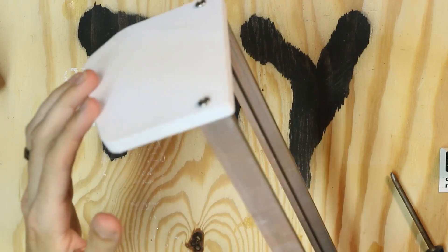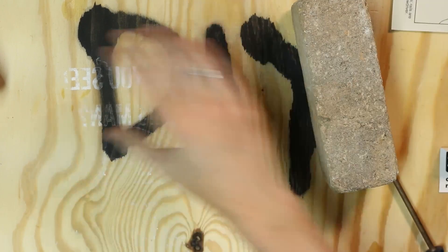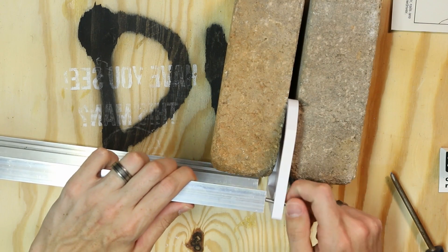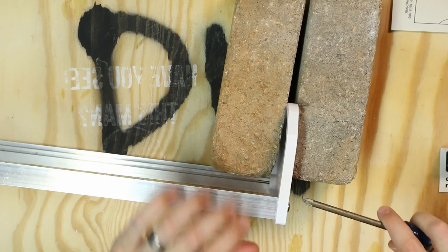I went for a bike ride because these side panels take a surprisingly long time to print. Now I've got both side panels and I'm going to attach them to the rails. I'm leaving the sides open for now but might close them later with acrylic. These screws drill right into the rails — they're self-tapping. Give them a good push when you're putting them in because they have to bend the aluminum rails a little bit to make their grooves, essentially tapping the aluminum as you drill.